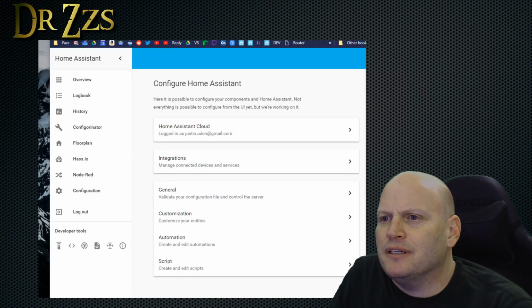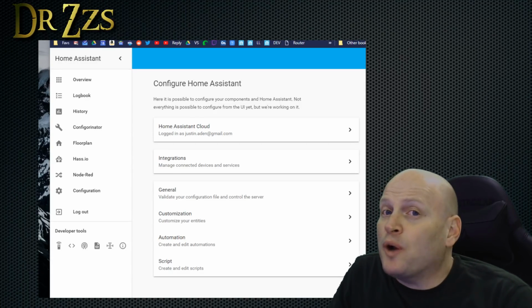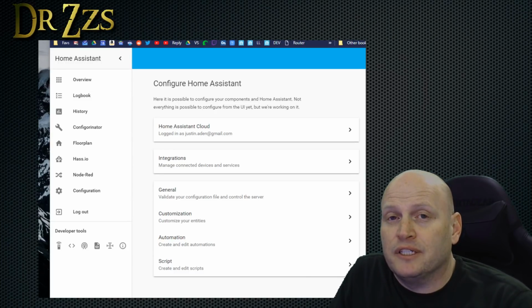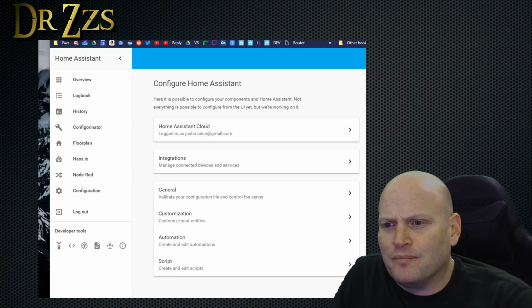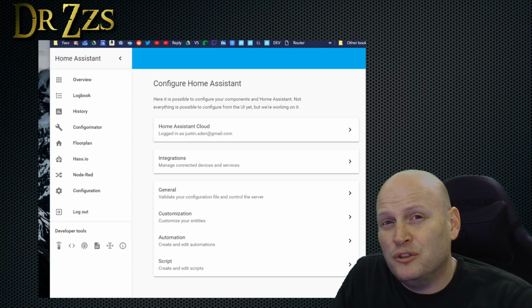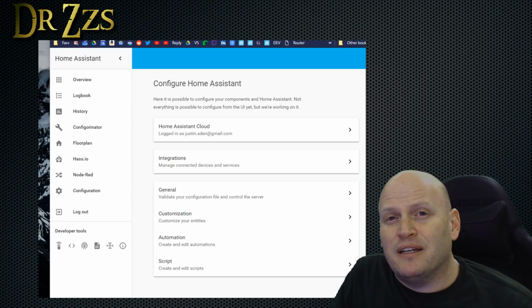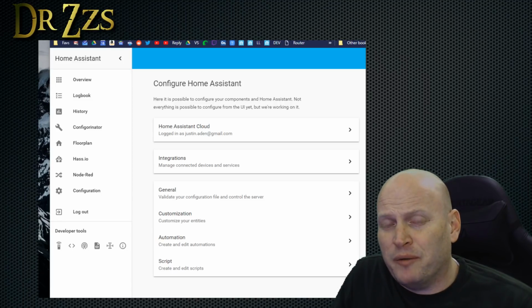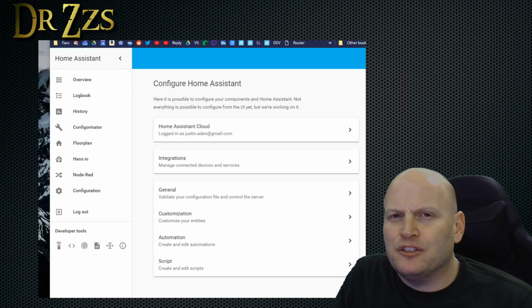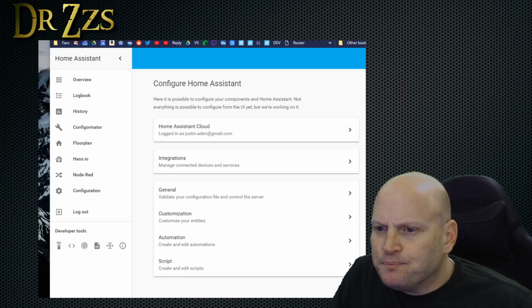Let's see. Four buttons press, the AP mode doesn't work. Yeah. So what Tony is talking about with Tasmota version 6, I haven't tried it, but what I've been hearing a lot of is that it's having a lot of problems with AP mode and being able to connect. And so I've just been telling folks that ask me to just keep going with 5.14, use version 5.14. And the few people that have come back to me have said, yeah, that it worked with 5.13 or 5.14. Theo and the gang, they'll get it sorted out, I'm sure.